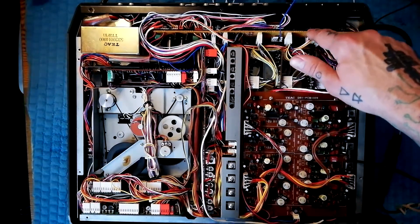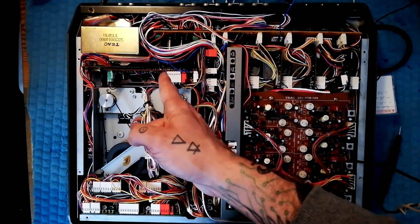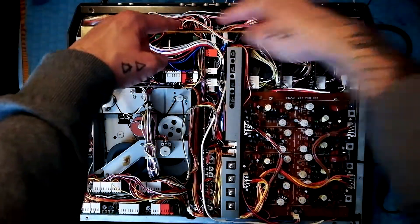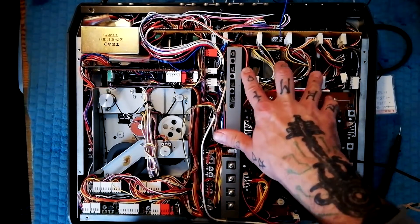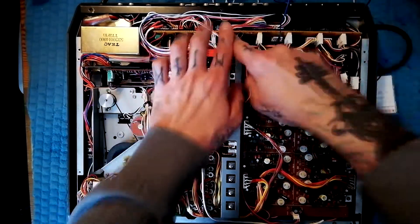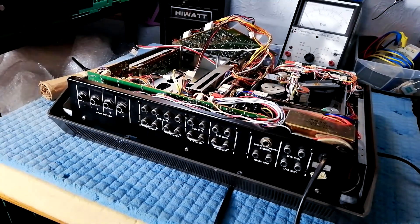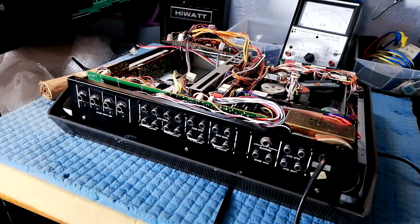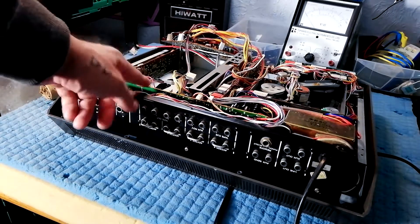I don't really like having to work on this too much because it's pretty hard to get at — it's got some voltage regulators down here attached to a plate that's attached to the chassis as a heat sink. Usually what I would do is leave it in situ: you can remove this back panel with three screws and leave it dangling down, disconnect the meter board which is back here, leave the DBX dangling, and then remove these three channels. That way I've got access to both sides of this board and I'll solder it with it still sitting in the chassis. I've already loosened off the DBX board and removed those three channels so I can get to the board from that side.